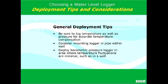If you're using an absolute pressure sensor and need to deploy a barometric pressure logger, it's a good idea to put that barometric logger in a place where the temperature doesn't vary much over time. If you have a well where you can place it below the ground surface but above the water table, that's a good spot where temperature doesn't vary very much, and that helps to improve your overall accuracy.